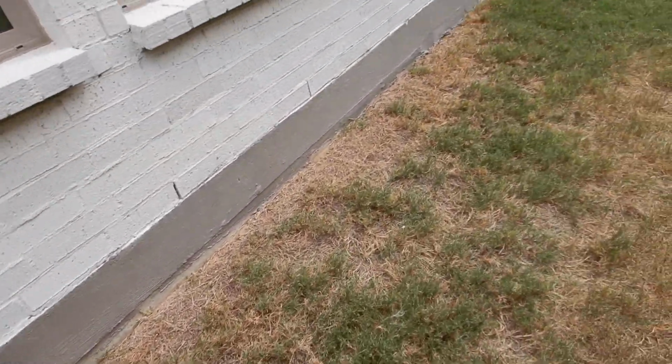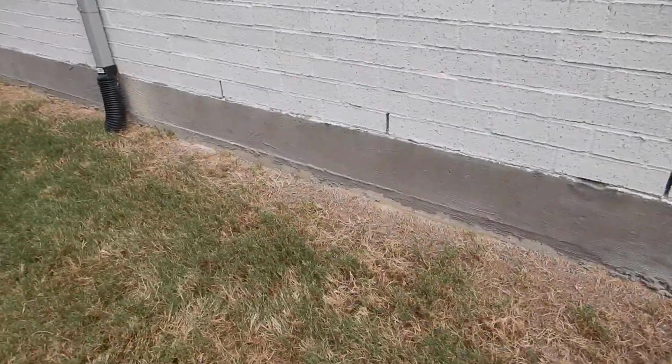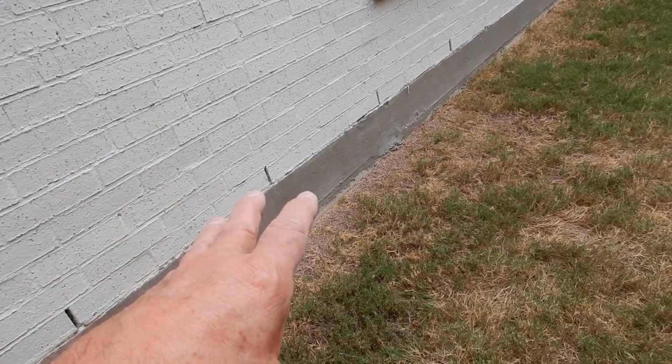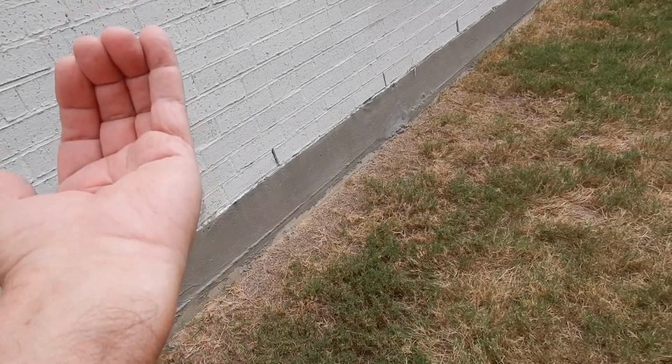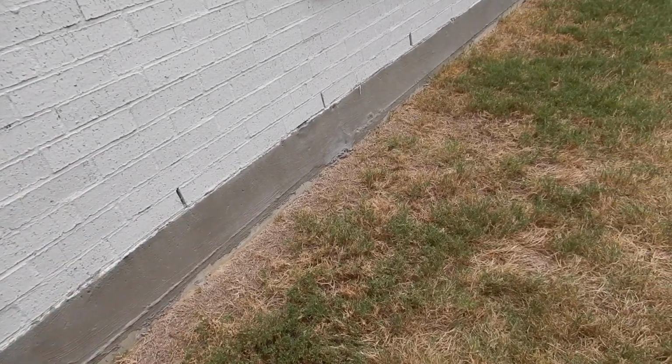Along the edge of the foundation, it looks like a cake frosting. That's called parge coating, and that's a decorative seal. If the foundation's cracked, a lot of times you can't see it because of the parge coating. Because of the difference in the materials, termites can come between the parge coating and the ground undetected, because they go through the void that parge coating has created.